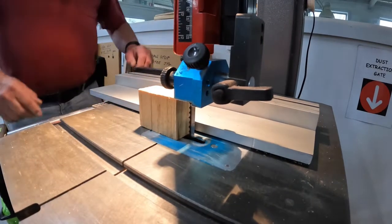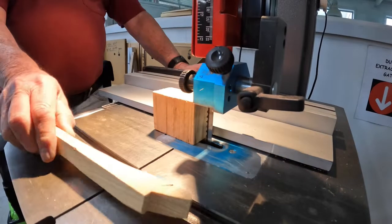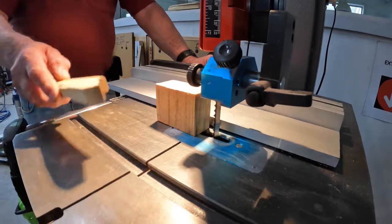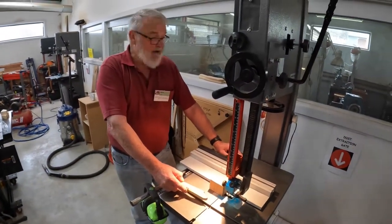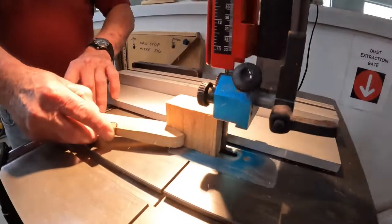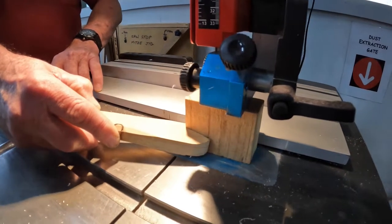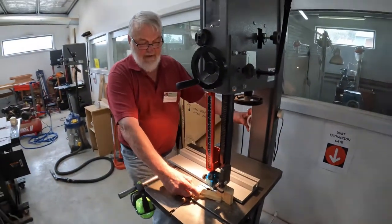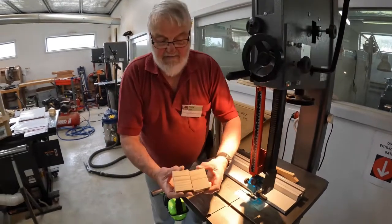As you can see where the timber is located, I'm going to be very, very close to the blade — so guess what I need to use. Have the timber ready to cut, close to the blade but not actually engaged. Turn the saw on and just push it through. And you can see what I mean by sawing with the grain.